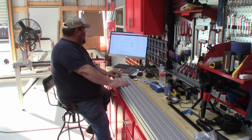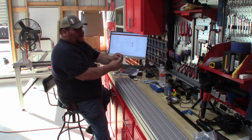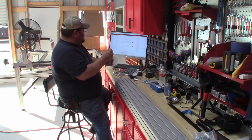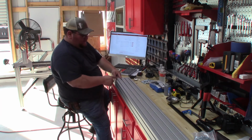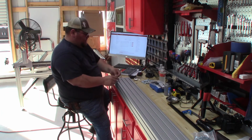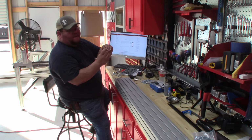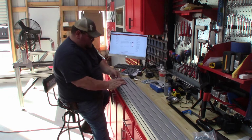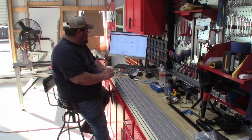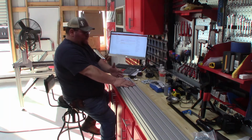It takes an 8 mil rolling T-nut. The long side of the T-nut goes in first. So we're going to slide 2 in each slot. Okay? So the long side goes in first. And these have a little spring-loaded, like a bearing that'll hold them in place. And on both of them it's long side in, and it stresses that you make sure you put these in the correct way.